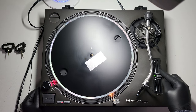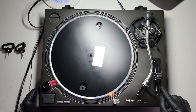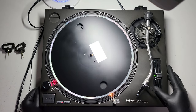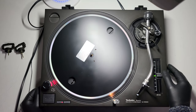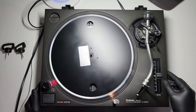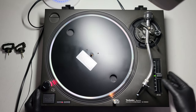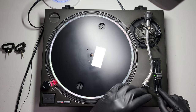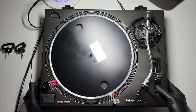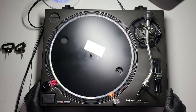If you've got scratched trims — this section here, the pitch trim — if it's all scratched and scuffed, this isn't really something to worry about. These parts are easily replaced. If you're booking in for a service with me, this part is replaced anyway. If it's in good original condition, keep it exactly as it is — one or two marks, that's fine. You can get the odd part where the lip on the edges can move up and down. You could try heat-pressing it back down with a bit of heat. Sometimes it works, sometimes it doesn't. Honest opinion: just take it off, clean all the old adhesive, pop a new trim on. They're not very expensive.